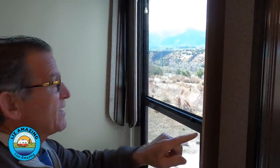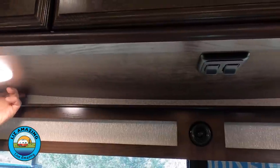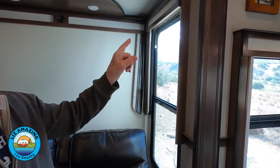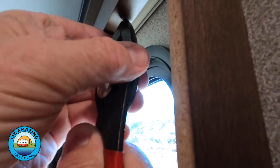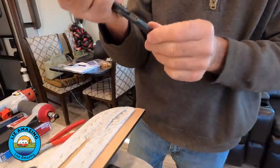To do that, I have to take this piece out of my way because I can't get the pin nailer in there to nail it. We also need to repair this because it's falling off, but to get in there to nail it, this has to be taken out of the way. One thing you want to be aware of when you take off any trim pieces: the pins or brad nails are going to either be in the piece you took off, or they'll leave one behind. There's one right there that's left behind. The way you get it out, you put a pair of pliers in there and pull it — get down as tight as you can, then move it forward and it'll rock it out.